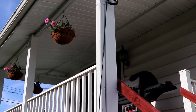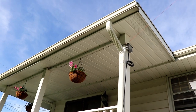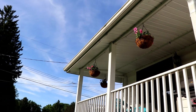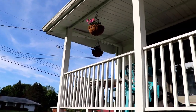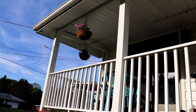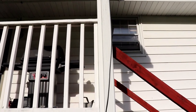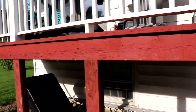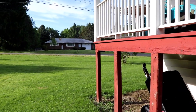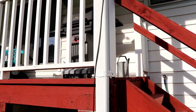You can see that here. I wanted to show you some of the minor changes that I made since the other night. The first change is I rerouted the counterpoise wire. You can see it going up along the top of the beam on the porch, and it goes down to the end of the porch and around the corner, where it just hangs down at the end — about 25 to 30 feet long in total. Prior to that, I had it running down along the rain gutter parallel with the coax.